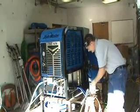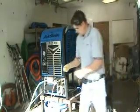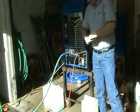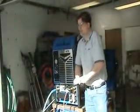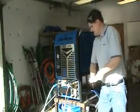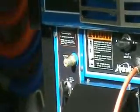Next, we'll take our descaling adapter and we'll thread it onto the end of our hose quick connect. Now for video purposes, I've got a second hose adapter here, but you could take your primary one off the end of your garden hose and use that if you like. And since we've warmed up our machine prior to starting the video, at this point, we'll just disconnect our water hose, connect our adapter onto the inlet water connection.